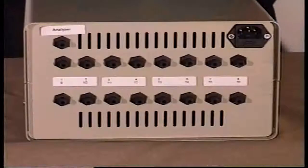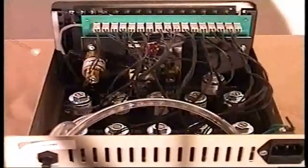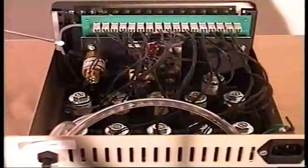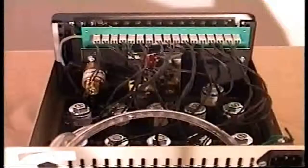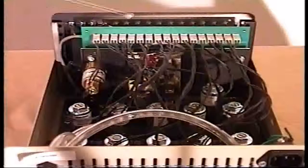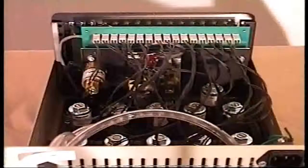Let's take the covers off and let you take a look inside. Here's a quick look inside this sequencer. We have the banks of the individual valves and there's our purge valve. Right here is the 12-volt power supply — incidentally, that will run on 220 volts, so if you have applications overseas this will handle anything from 90 to 250 volts. And this is the back side of the processor board. These white connectors are where the actual valves connect to the processor board. And up in here are the back sides of the valve-indicating ID LEDs for valve identification.